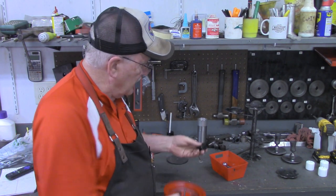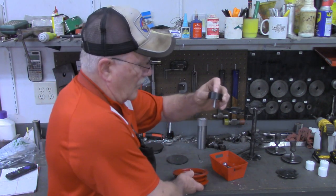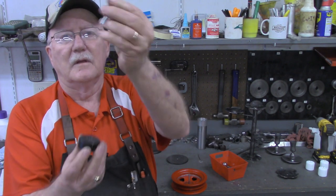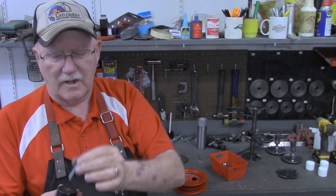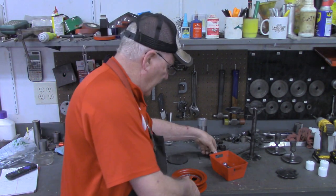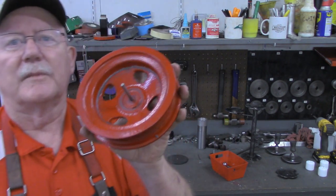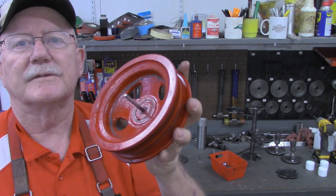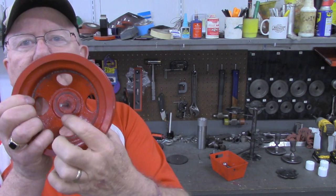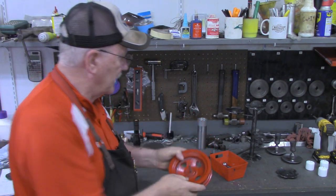So what I did — remember the screw was down in the die just as a guide. That's what the five millimeter hole and the screw is for: a guide to keep everything lined up. Well, I got some five millimeter tool steel pins — drill rod — and I put one in with some thread lock to hold it in place.